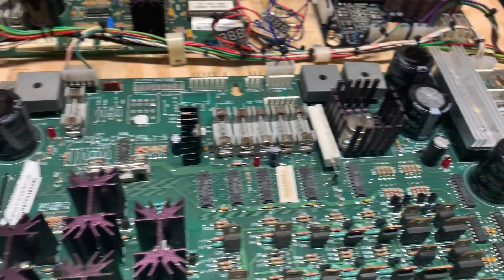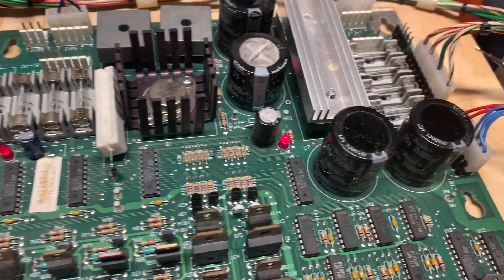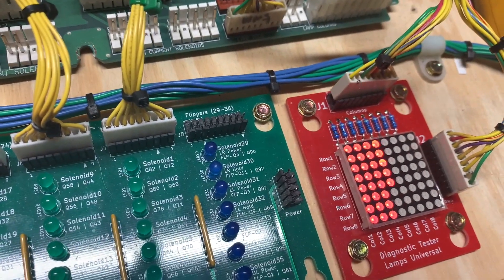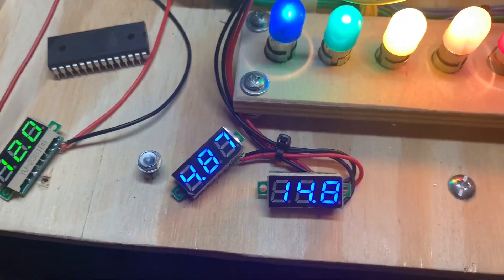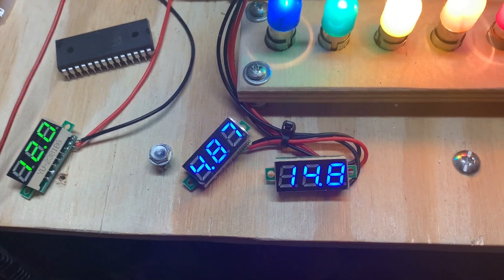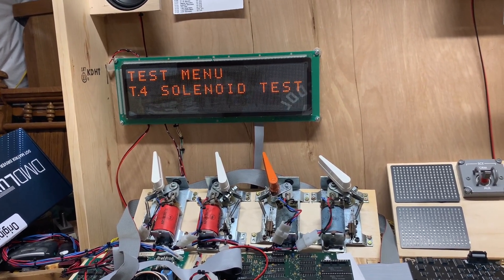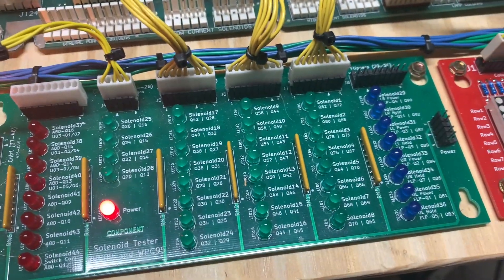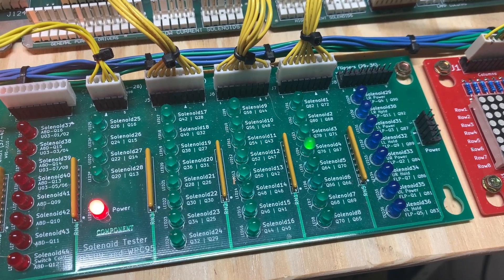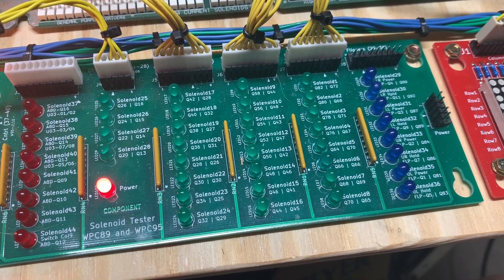Back on the bench now after BR1 has been replaced. Let's power on — we'll see if the driver board LEDs light, and they do. That's the 12-volt LED and this is the 18-volt LED. The lamp matrix is doing what it should. The 5 volts is 4.87 — that's not a very good reading off of this Chinese voltmeter, but that's plenty in a game actually. The 12 volts is back at 12.00. It's more than just that voltage reading that causes game resets, and since we've got a good clean 5 volts out of this board now since I replaced C5, I see no reason this board won't perform perfectly. Also replaced power headers J101 and J114.